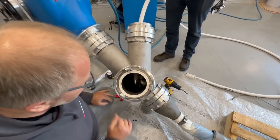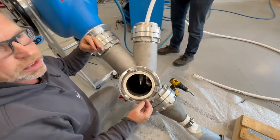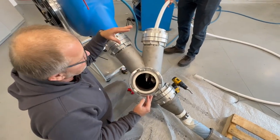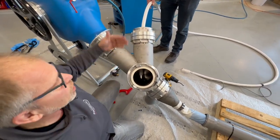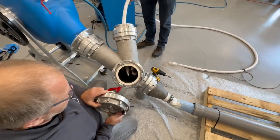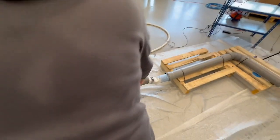What we have done now, we just connected the light hose with the end of the liner, so that when we do the installation, the liner and the light hose will go in the same way into it, and the liner will also help the hose to pass all the bends. So I just seal it, close it here, and then we go on with the installation.